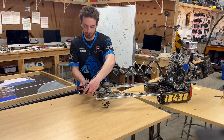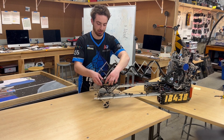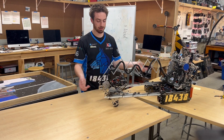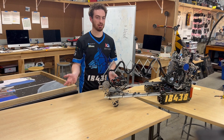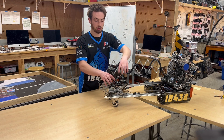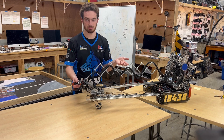The next fail-safe is: if we grab and then retract, and the intake slides start retracting but the fixed break beams aren't broken, that means we don't have a cone in our grasp. So what we should do is re-extend again and go reach for the cone stack, returning to the same state as before.